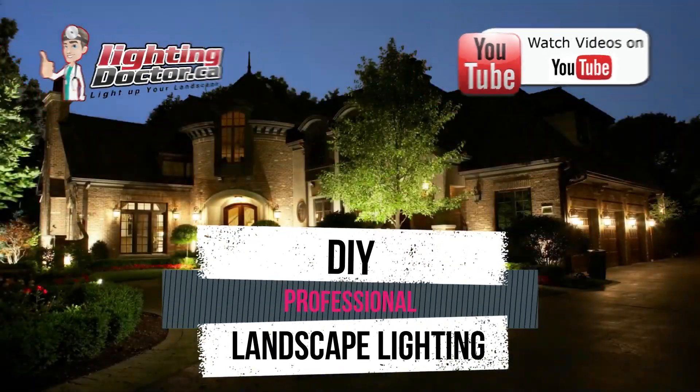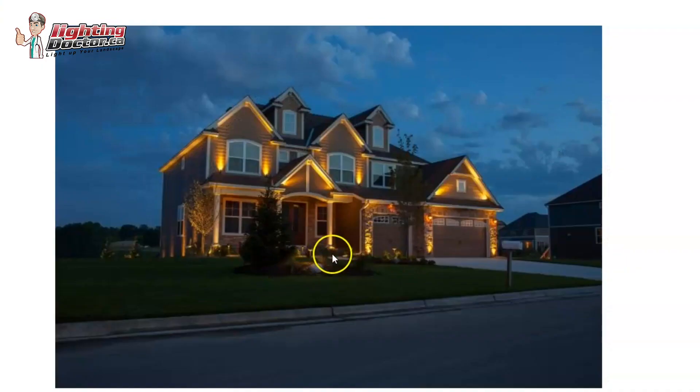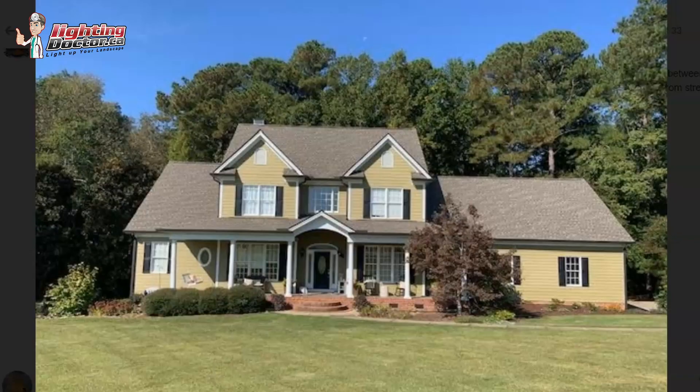Looking at this, I think you're on the right track. The first thing I would do is definitely try and highlight all these pillars. I wouldn't worry too much about the beam angle. You can get something a little bit narrower, but here's why I don't always like doing that: if the beam angle is too sharp, the pillar is going to stand out more, but you also get more of a hotspot. I like sticking with the 35 degree angles because it spreads more light up top, especially with multiple pillars. It does a really nice job of lighting the eaves and the soffit — it's almost like you have pot lighting.